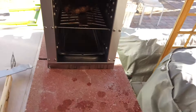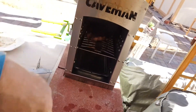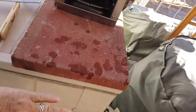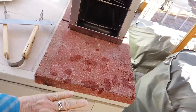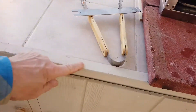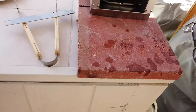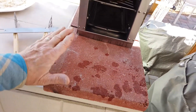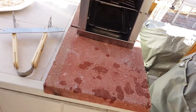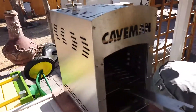Here's a quick tip: while I was doing the burn off yesterday, my cabinet here — I have since put this block on here — it was getting real hot and this is wood. That was getting pretty warm just from the open door. So if you have it on a combustible surface, please use something that will not burn, like blocks.